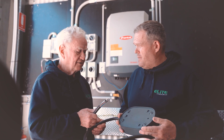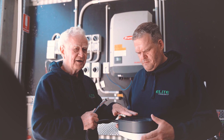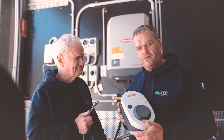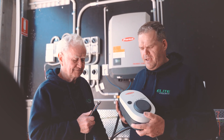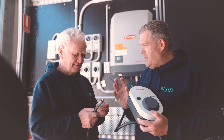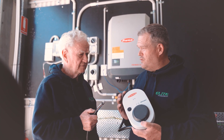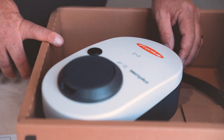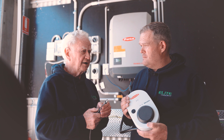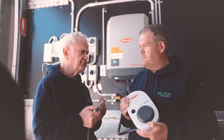We certainly like their inverters and their hot water system. This is a mounting plate — clever little way they've done that. What intrigues me about this thing is it's so small and so light and so powerful. That's the Fronius Wattpilot, and I'm going to pass it over to Frank the brains trust and let him start tinkering with it and install it. We'll shoot some more videos and plug it into the Tesla or any other vehicle. I'm interested to see how they schedule and how you prioritise the usage of power. I think you need to have the Fronius smart meter installed for this — it talks to the smart meter. The smart meter basically looks at the energy coming into the property and the energy going out from the property and makes decisions about energy flow: where it should go, whether it should go out, whether it should go into the EV, or should go in other places.